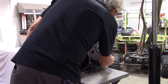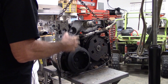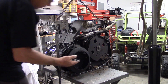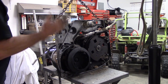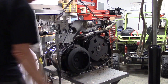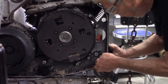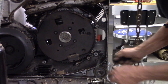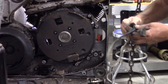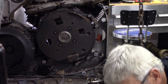I need to get these coil packs off of there — I'm buying brand new ones for it. You can see what trouble you have to go through to put them on there, and the last thing I want is to have to take this thing apart because one of them was bad. It was being worked on because it wouldn't start, so I'm going to eliminate that right off the bat while I'm down here. Next thing I'm going to do is get these coils off and then get this flywheel off. Push that rubber grommet out the top — it's split so I can pull it off of the wire. I saw a few bad spots on the plug wire and they're not snapping into the spark plug very tight.